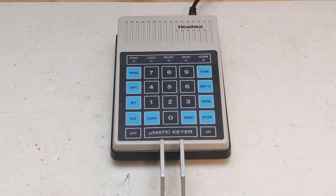The front or top panel has a membrane keypad that controls operations. Five LEDs indicate the operating mode. The built-in paddles are at the front — a unique aspect is that the paddles are touch sensitive and don't require any pressure or movement to activate. This takes some getting used to but works quite well in practice. The default is for the left paddle to send dashes and the right to send dots, but this can be reversed with a keypad command or wired as the default if desired.